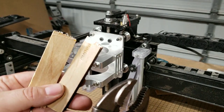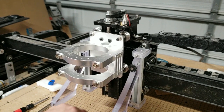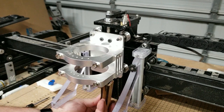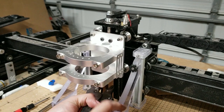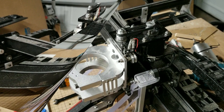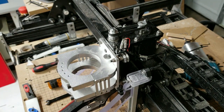What I like to do: two wood blocks, a pair of channel locks or vise grips, and with two hands you go in. It's a little tricky to get positioned sometimes, but you go in and hold the wood blocks in with one hand, come back in with your pliers, square up the tips centered with the lead screw, make sure you're on the wood, and clamp it down tight. You're not going to hurt the shaft of the screw if you're using wood blocks like that, as long as you don't overdo it. Now that we've got the lead screw clamped between the wood, I've changed camera angles so you're not seeing my arm while I'm doing the work.